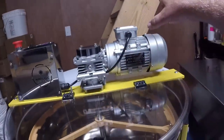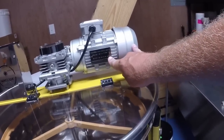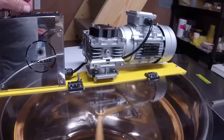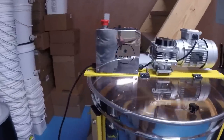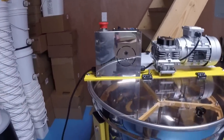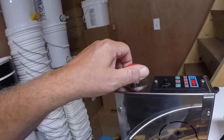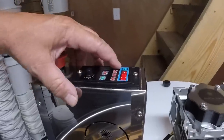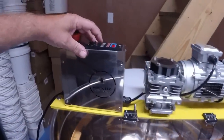We're going to find out how it works with honey, hopefully in about a week. It's a three-phase motor that runs on 110 through the power supply and only draws 2.9 amps, basically 3 amps — it's a really nice setup. Of course, if all of a sudden I'm spinning it and something happens — the frame gets loose, gives way, something — because I don't fasten properly, the whole motor shuts off. Emergency stop. I hope I don't ever use it. To reset it, you turn it back on — once it's on, that light goes solid, you hear a fan go, and you're back up and running.